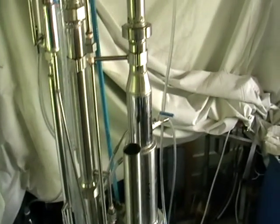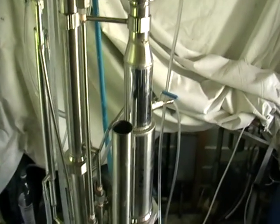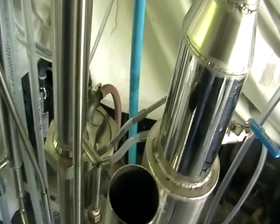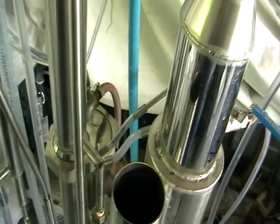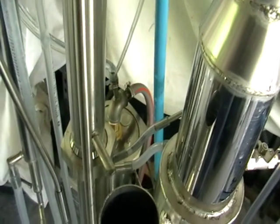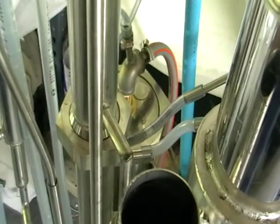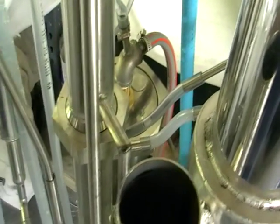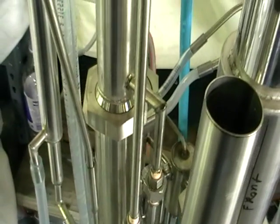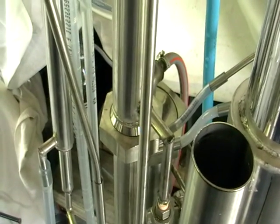Here's a fractional column with a water separator. Water that's actually separated from the first stage, with some spirits, is redirected back into the first column to the bottom section to redistill it again — to evaporate the leftovers of the spirits.